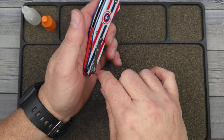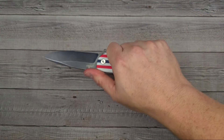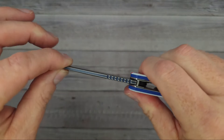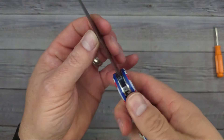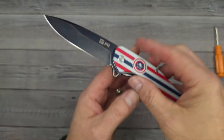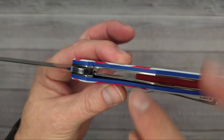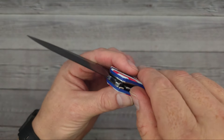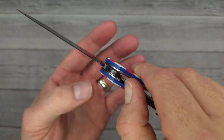I think this is a great knife to learn how to work on your knife. In the hand, the ergos feel good. It has decent jimping up here, but I'm feeling movement left and right — I need to tighten it up just a little bit. I'm getting movement up and down, and what that tells me is I need to adjust it. I need to tweak it a little bit. What I would need to do is take it back apart, and this liner — I need to slightly bend it that direction. Pushing this way, that took care of it — that's when you make an adjustment to a knife. This is a perfect example of making an adjustment.